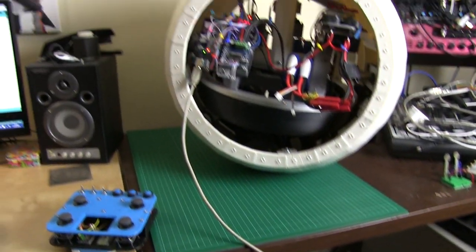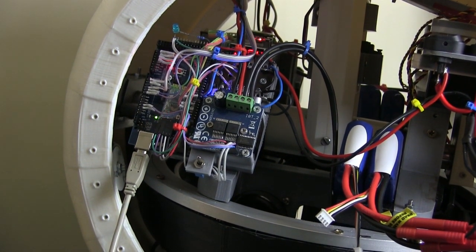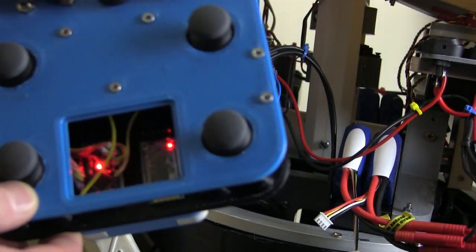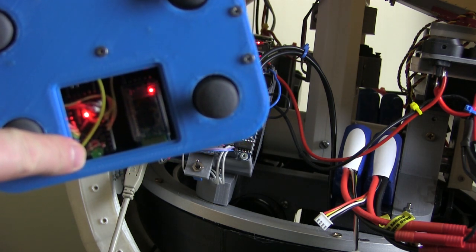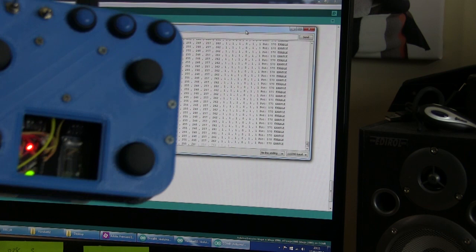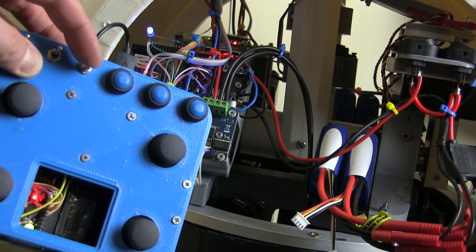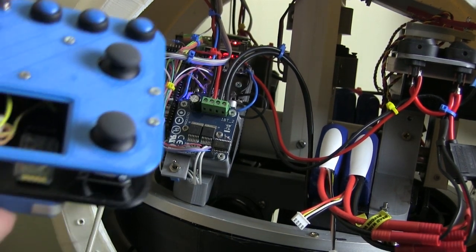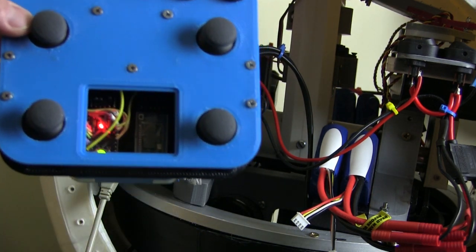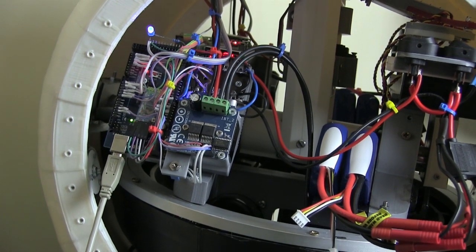If I press the buttons one by one, we can see those ones changing to zero. If I flick button 4, as well as that going to zero, we now get 'enabled' — so that's taken that pin high which goes to the motor drivers. I've still got those hardware switches to actually turn them on. So the droid is switched on, and I still have my data streaming to the console via a USB cable plugged straight into the PC, reading data straight out of that Arduino.